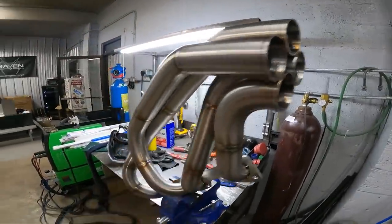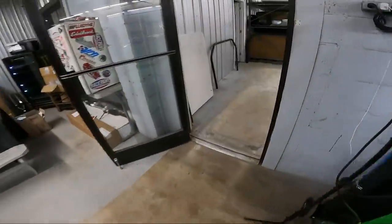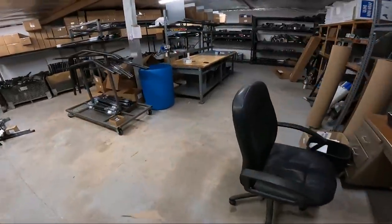So I want to go back here. We've got some collector stars. And a lot of people use spikes. No, you can't really see me back here. A lot of people use spikes, but on a turbo car, a spike really isn't even needed. I don't think you see the advantage of it when you're actually making back pressure versus a naturally aspirated car or a nitrous car. The exhaust is flowing out, so the spike is actually helping. But in a turbo car, I really don't see the need of it. If anything, the spike will come loose and go through the turbo.